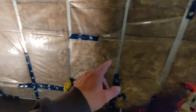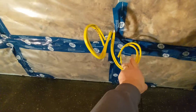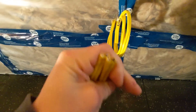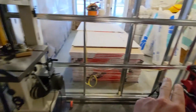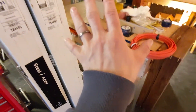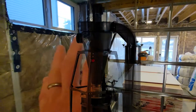This circuit is currently running all the way around this little U-bend. The idea is most of my power tools — at least the larger ones — will be on this wall. I just recently got a 4-horsepower 16-inch jointer-planer combo, which is going to live right here in the middle. Each station has a 240-volt and a 120-volt circuit. This is good for a 20-amp circuit, 12-2 meaning 12-gauge 2-conductor. So I'll have two receptacles there, another two, another two, and another two. In the back I've got one dedicated for the table saw, and most likely the bandsaw and maybe drill press. This little guy here is a dedicated 240-volt 20-amp feed for the dust collector, which is going to live tucked away in the corner.